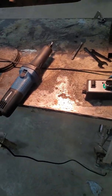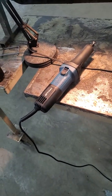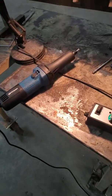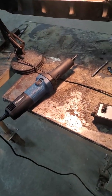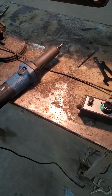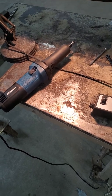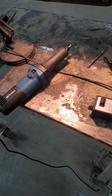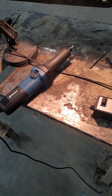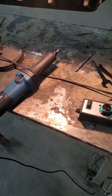I was trying to look for different ways to control the speed on my electric die grinder. I'm kind of new to using the electrics and I bought a cheap one just to see if I'd like it. It doesn't have variable speed because the variable speed ones are a couple hundred, closer to $300. I was looking for a way to slow it down because running wide open they're just too fast. I tried running it like that for a while and I was just annihilating cutters because they'd get to bouncing around, just start knocking the teeth off of them.